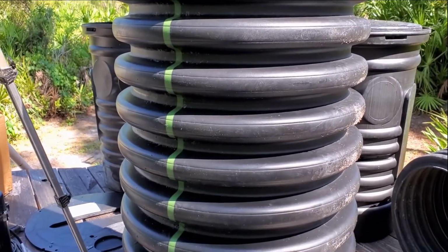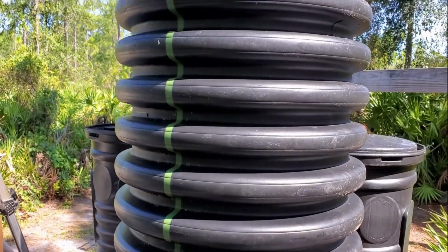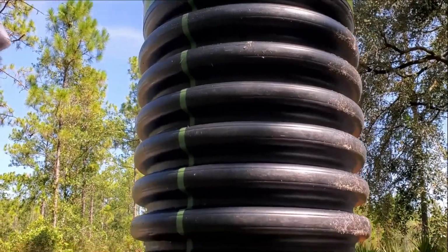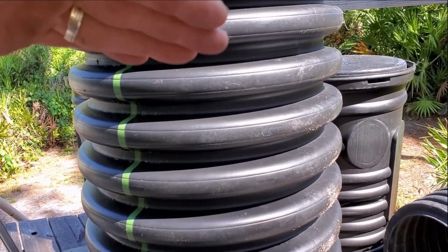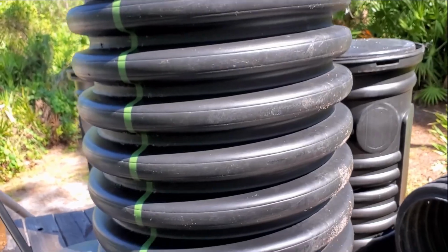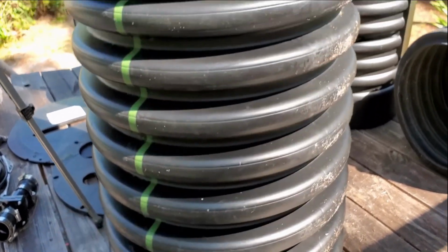When you're trying to achieve more fall in your yard, of course, it's simple. You know, I've been saying this for years and years. Install a sump pump. It's just that simple. You can get as much fall as you need. And you would basically bring your lines in at whatever level you want. They'll just come into it. You drill a hole in. That's where your pipe comes in. Water goes down to the bottom, and the sump pump lifts it up and sends it out.